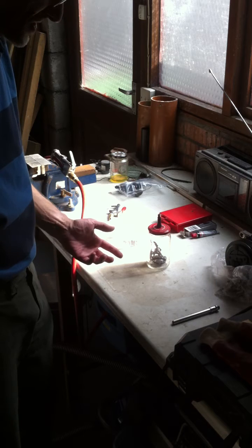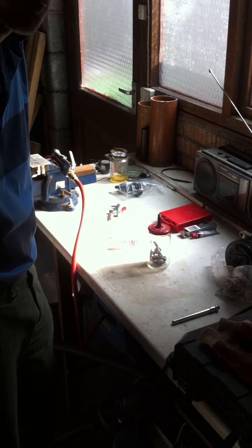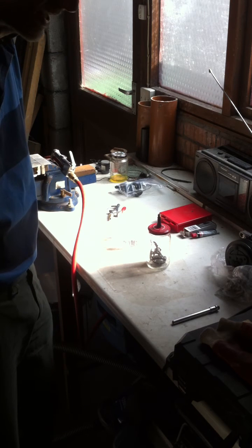What this is doing is forcing air inside the watch, so any holes will take the air in, increasing the pressure inside the watch. You only need to leave this for a minute or two, and depending on the size of the leak, the pressure will equalise quite quickly.